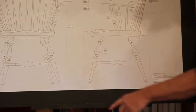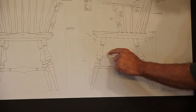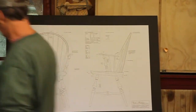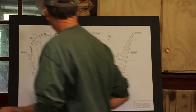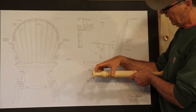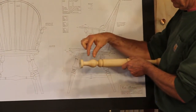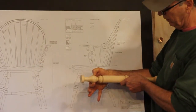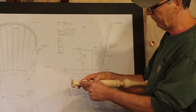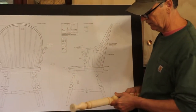On these legs that are tapered like this, that's not real important. You could take off a 1/2 inch, you could take off 3/4 of an inch, and you probably wouldn't even see any difference there. But the reason that I have it calculated that close is because of another leg, which, excuse me a minute, I'll grab it. So it's one of these ball and cylinder legs right here. You see there's the end of the foot, of course, and here you want to cut off the minimum amount of the bottom of this leg to have as much below this bulb, this vase, as possible. And of course, if there's much difference between one leg and another leg, you'll pick it up a whole lot more because that space is so short. So that's why I've got 9 3/4 on these to match any leg.